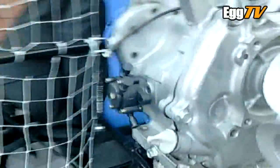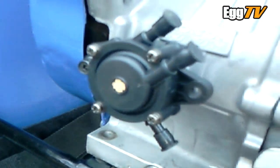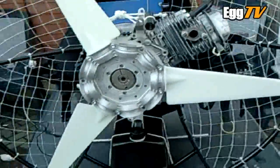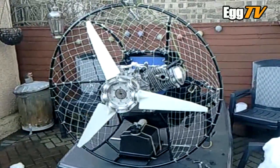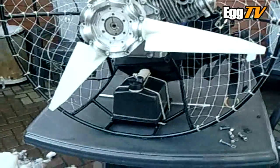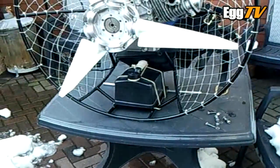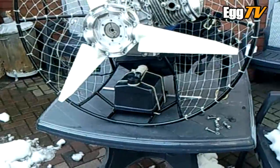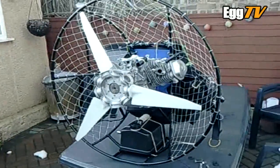I've got the pulse pump on as well. I'm not sure on this type which port is the pulse feed and which is fuel out or fuel in, but I can always rejig it - it's just on for now anyway. As soon as I get the brass pulse connector sorted I can sort out the tubing, and I need to get a clunk weight for the fuel tank, or maybe just drill through a cap head bolt as a clunk weight. Anyway, that's what it looks like at the moment. Catch you later.